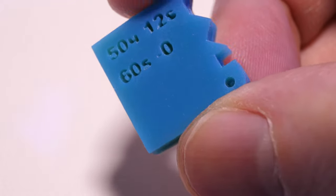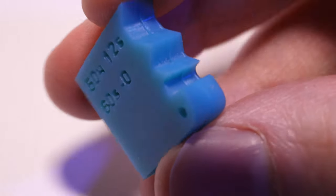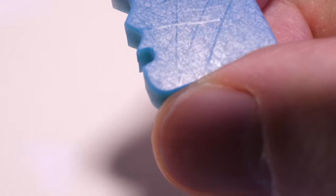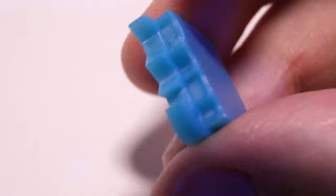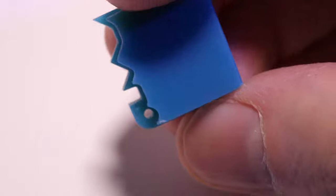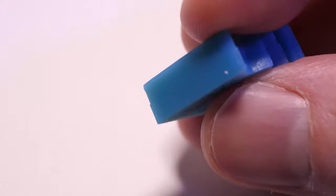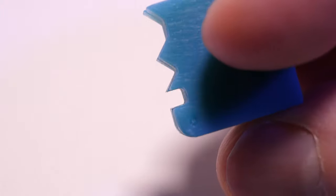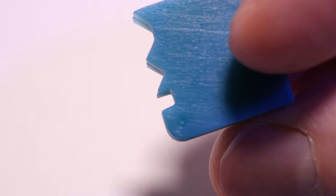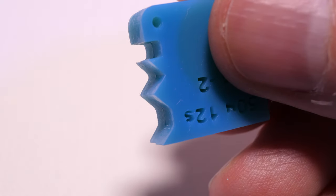What we're attempting to do here is find out how much contraction will exactly undo the expansion, so you could just reduce the bottom layers of your print by that amount to remove the elephant's foot. Spoiler alert: it's going to be like two pixels, maybe three. And unfortunately we can't go in half pixels, so you have to pick which one just looks best for you. Here are the results of this print test for me. Here is the no reduction chip — you can see the ridge. On the other end of the spectrum is the 10 reduction chip — clearly it's eroded away. And this is the two pixel contraction — it's pretty good, but it's not perfect. And the hole is completely gone on the back, because as described before, the light leak is happening from all around it.